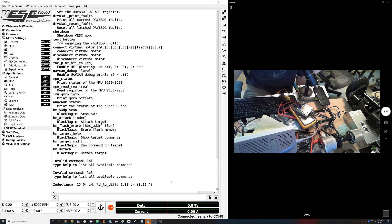You don't really need to worry too much about all these numbers. The key thing to note is I have a measured inductance of 15 micro Henry, and then the LQ-LD difference — basically as the motor spins the inductance value changes, and that's what HFI uses to locate where the motor is at zero velocity. The bigger this difference is, the better it is for HFI. For this motor we have about 15% of the total inductance changing as the motor spins — not a lot, but probably enough for HFI to work. If you get down to something like 5% of total inductance, HFI might not work so well.